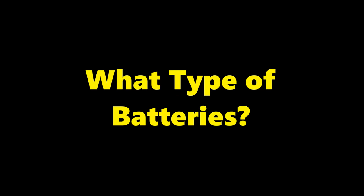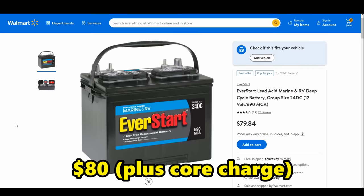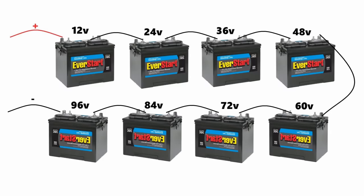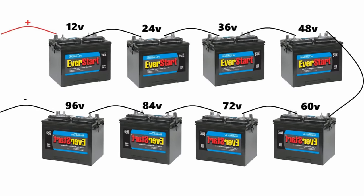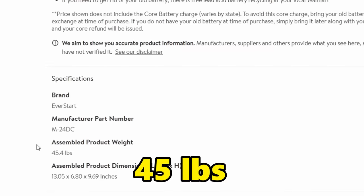Now that we know that, the next question is, what type of batteries are we going to use? The old tried and true lead acid battery comes in at an affordable $80 plus core charge from Walmart's finest brand, Never Start. It would take 8 of these lead-acid 12-volt batteries connected in series to give us a desired voltage of 96 volts, which would cost around $640. There's just one catch, the weight. Coming in at around 45 pounds per battery, that would be over 360 pounds we add to the jet ski, which is way over our limit.